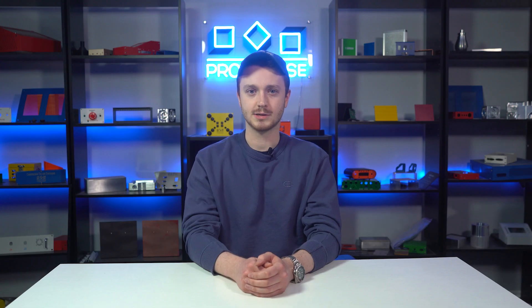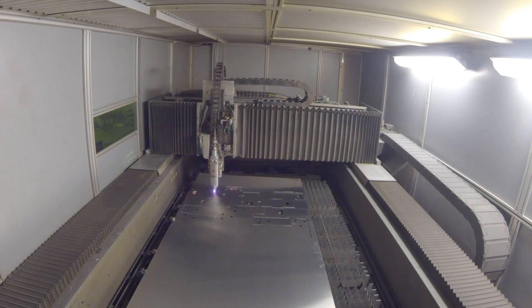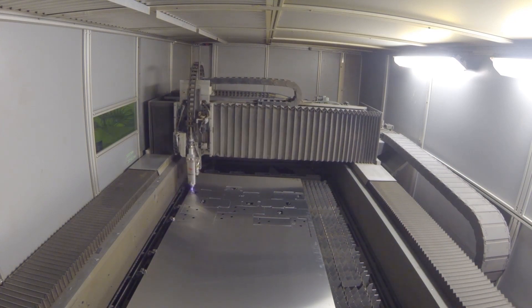There are many different types of clearances in sheet metal design here at Protocase. The first one we want to talk about is your cutting tolerance. We cut the majority of our parts here on fiber lasers. This computer numerically controlled machine uses optical fibers to create a laser beam that is extremely hot and is then used to cut through sheet metal stock. This machine has a plus or minus five thou tolerance when cutting flat profiles. So if you have a piece of metal that you want to cut that is one inch by one inch, the possible range of the final size could be anywhere from nine hundred ninety-five thou to one inch and five thou.